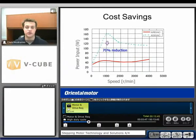That could equate to some cost savings as well. Based on the speed range we're at, we can get up to about a 70% reduction in power input. It's not always 70% — that looks to be right around 1,000 RPM — but even at 2,000, 3,000, or 4,000 RPM, we'll see a pretty significant reduction in power input. This was specifically looking at the AR and the AS 69.